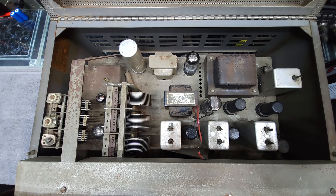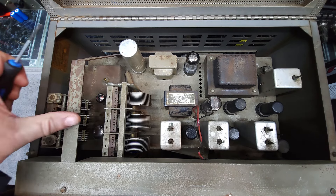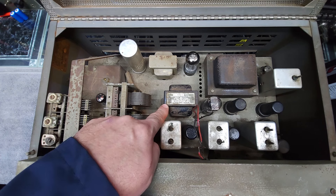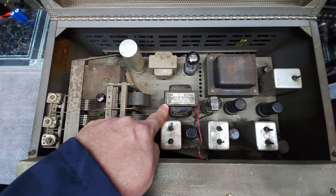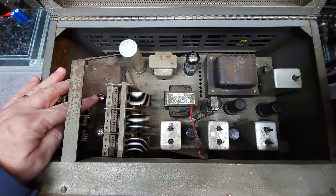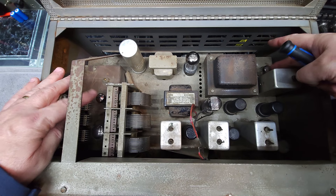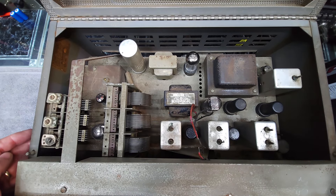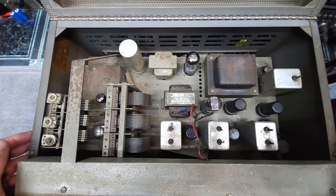Taking a peek under the hood — right off the bat, rust. The transformer's rusty; even the tops of the tubes are rusty. From the inspection perspective, somebody has replaced the output transformer — this is not an original transformer. The wires to the panel lights are severely dried and broken. I can see two tubes here; that looks like probably a 6AL5. They're missing their shields, but I can replace those — it's not a huge problem. But it's rusty, that's for sure.